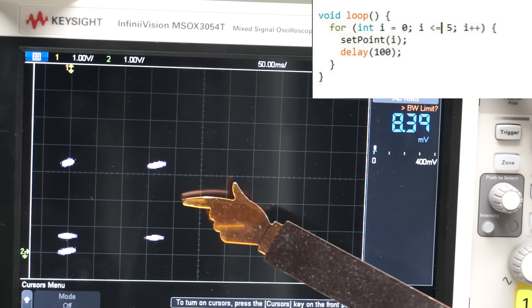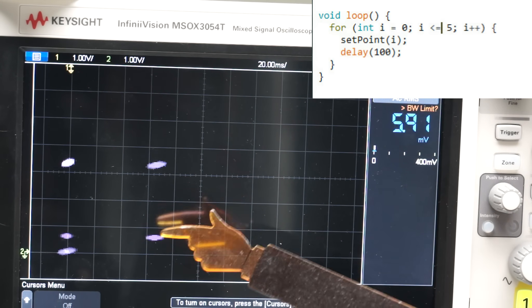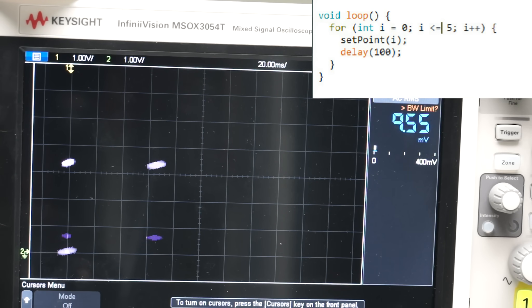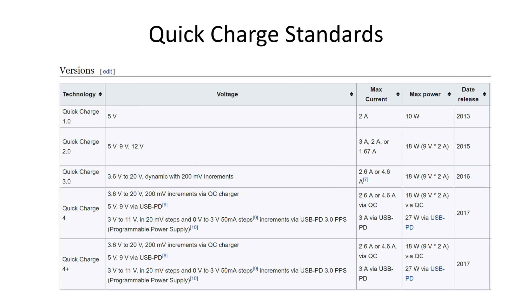Just a quick demonstration — I switched the oscilloscope to XY mode. Now we can see that we can reach all 6 points necessary for the QC standard. By the way, if I switched to the unsupported 20V, my two devices delivered 5V instead. So today I will use QC 3.0, because the newer chargers offer QC 3.0, which is an extension of QC 2.0 that provides a variable voltage.